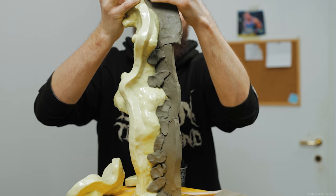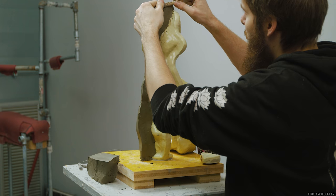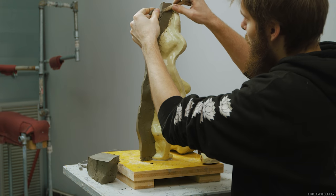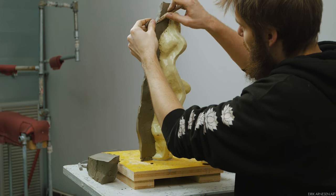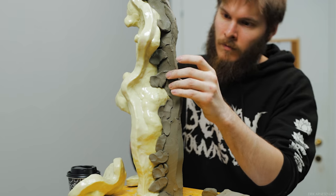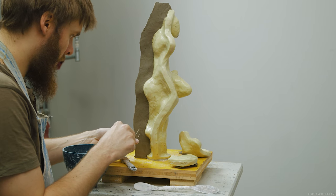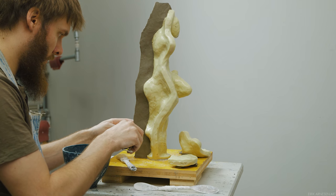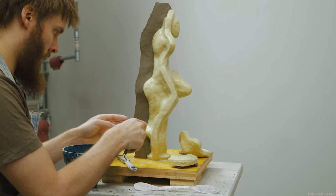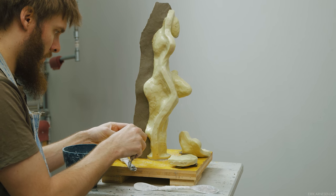The clay wall separates the two halves of our mother mold and will become the surface of one half of our plaster mother mold, so it needs to be pretty smooth. The back side of it — the one we're not casting right now — can be rough and should be reinforced with clay so it's sturdy and won't buckle or move while you brush plaster onto it. Registration keys are drilled into the clay wall to make sure the two pieces come back together in the same way every time. We're also going to drill holes and bolt the two pieces together into one half, but registration keys are good practice regardless.